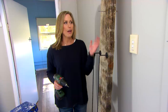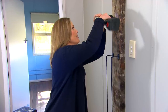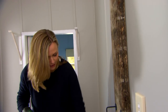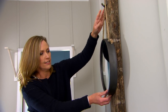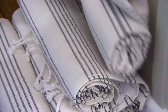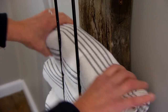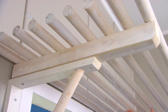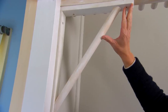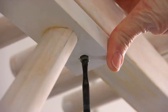This sits flush against the wall — I've notched it out a little so it goes snugly over the skirting board, making it easily removable without any damage to the building. This is a pretty substantial piece of timber so I'm drilling directly into the wall stud. I've added a hook which will be very handy for a mirror by the door — perfect for putting on your sunscreen — and for those beach towels rolled up neatly, they just slide in between. The luggage rack goes right above the door on brackets made from offcuts, screwed in from underneath.